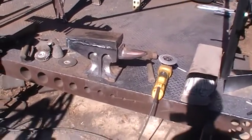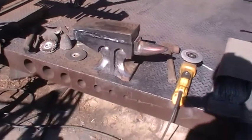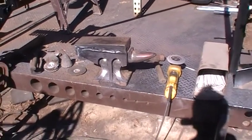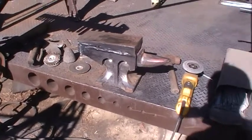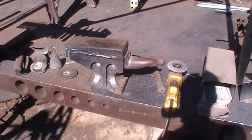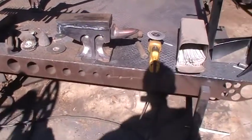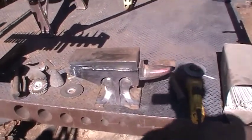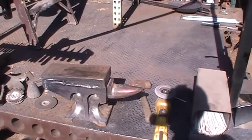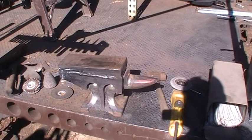The good news is these are cast steel. I see a lot of people reworking their anvils — a cast steel anvil does not have to be preheated. You don't have to get it up to 200, 400, or 500 degrees. You just clamp stuff, fit it, tack it good, and start welding. Now the forklift tine — I don't know exactly what steel they make them from, but they're made for tensile strength. They probably don't have manganese in them, which is impact resistant, but it is a better steel than just mild steel. So we got a forklift fork welded on top to make it look a little bit like a church window anvil. You tell me what you think. Talk to you later. Bye.